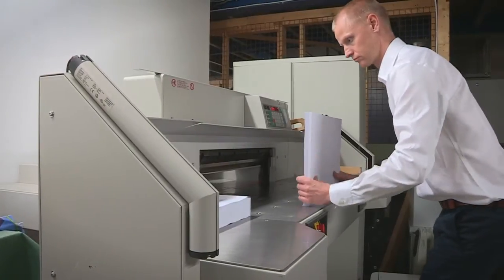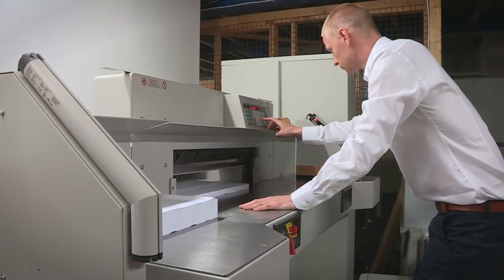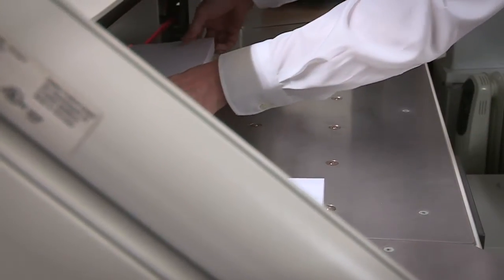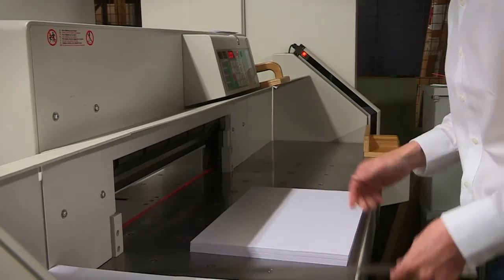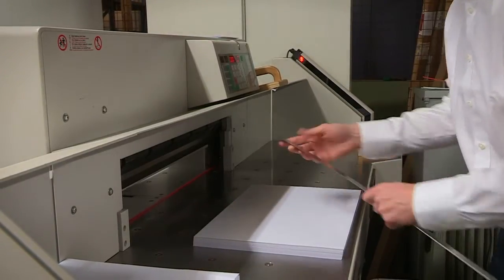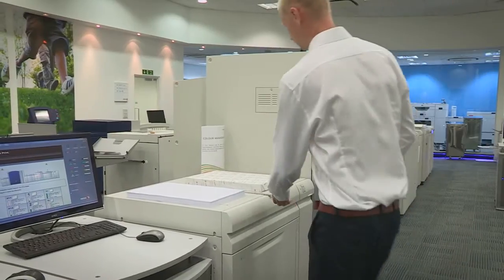Prior to printing, it is important that the sheets themselves are square and uniform. If the diagonals are not equal, the sheets are not uniform and square, and the booklet quality will vary as a result. Do the same for the cover if a different paper stock is used. This problem is more common than you might think, not only when you cut your own paper down from larger sheet sizes, but also for factory cut sheets.